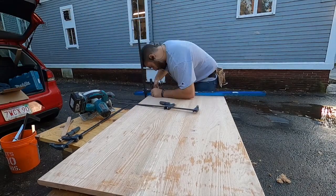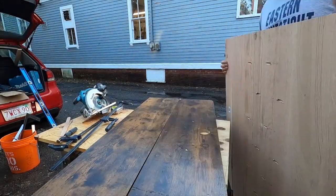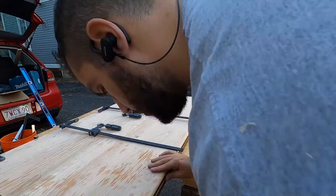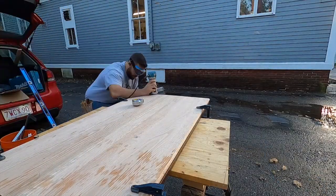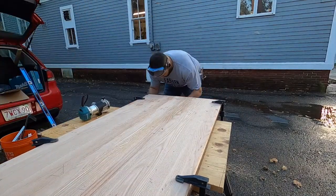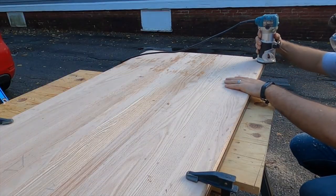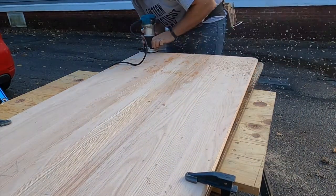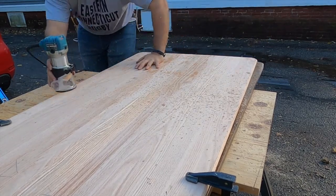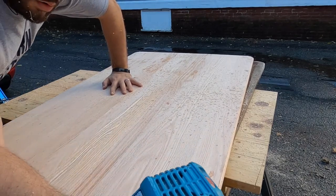The wood got a little wet — I went through a rain squall and had to stuff everything in the back of my car, but we make do. Now I'm clamping everything tight to the table and using the router to follow the original roundover pattern from the old desktop, since I don't want to freehand a curve on the side. I'm using a roundover bit to make sure the roundovers are nice and even all the way around.